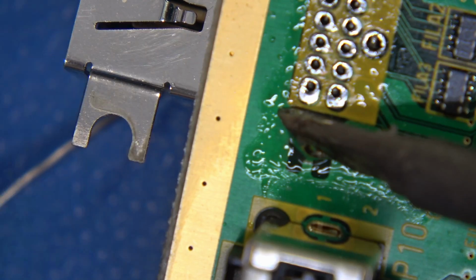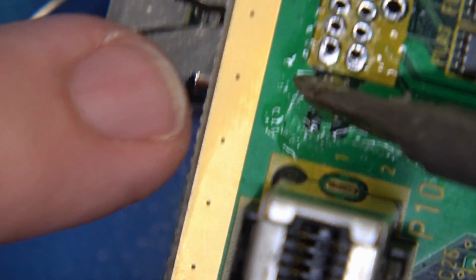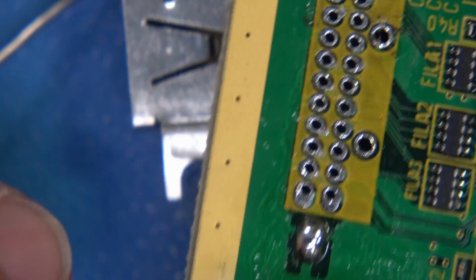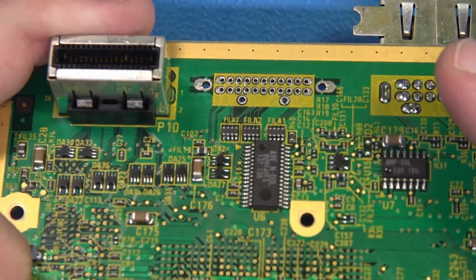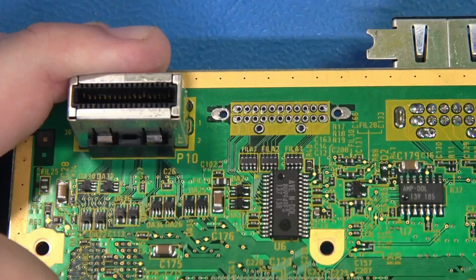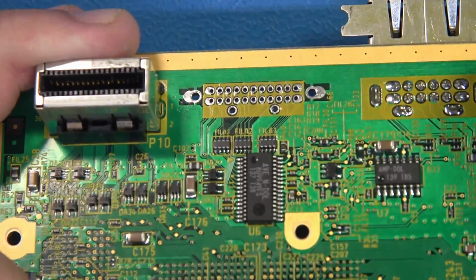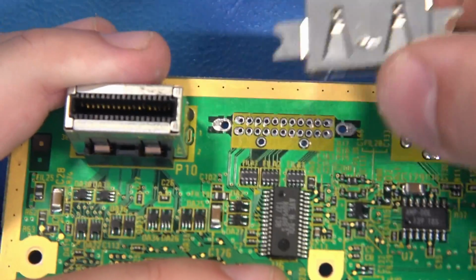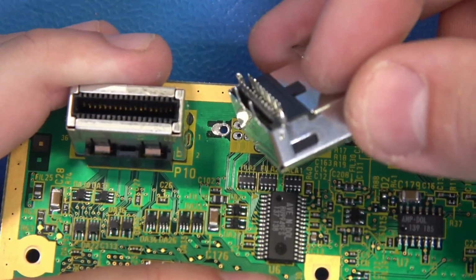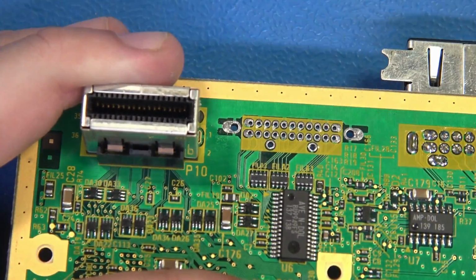I'm not using a lot of force. Watch my pinky. Watch my pinky. Just a little bit here. Boom. Literally like butter. Let's zoom out and talk about that. Now we've cleaned the side here and this looks perfect. This pull went beautifully. And of course, when we use proper through-hole equipment to remove through-hole components, we don't damage them. This port is immaculate, and I'm going to save this because really these digital ports shouldn't be thrown away. So I'm going to put this to the side.